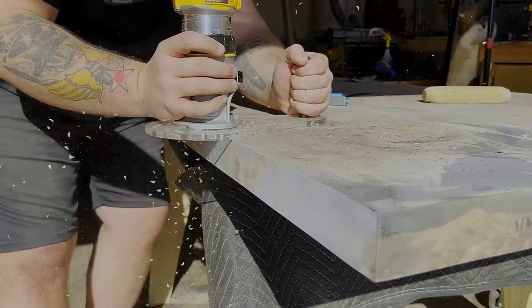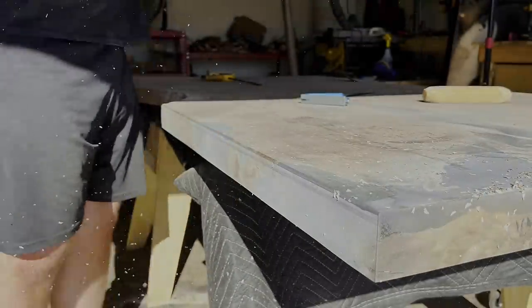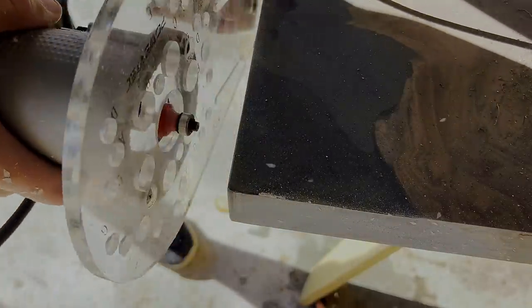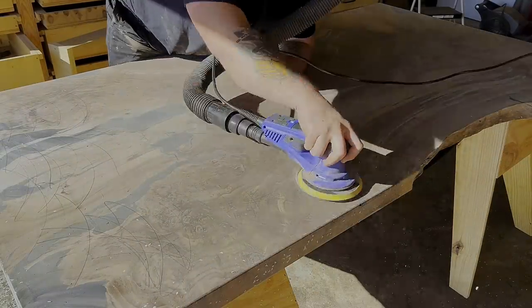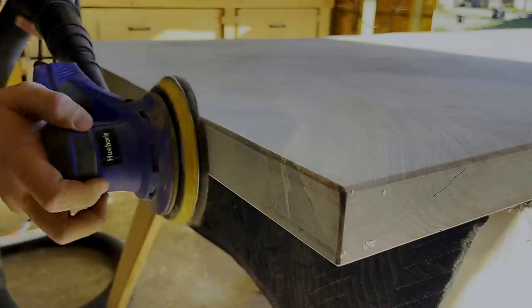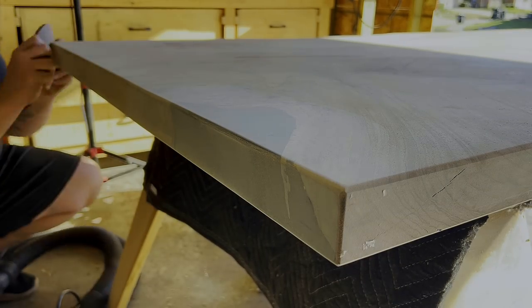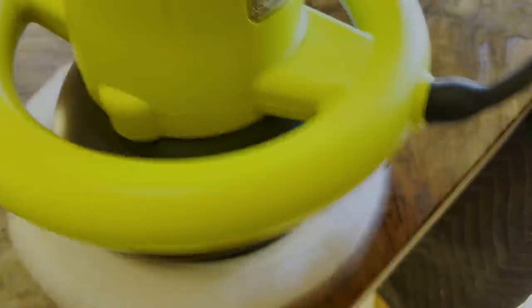This little router base plate thing with the handle is freaking awesome. It gives me so much more surface area to actually balance the router - I'm really bad about accidentally tipping it, especially when doing corners. But with that extra surface area, this was like butter. Once I put all my roundovers on, I put a soft pad on my sander with 320 grit sandpaper for the final sanding. A soft pad is required to successfully sand these corners because you're really going to mess up the proportions if you don't use your hands or a gentler pad.